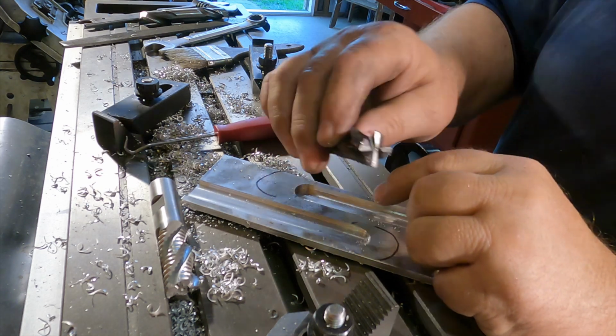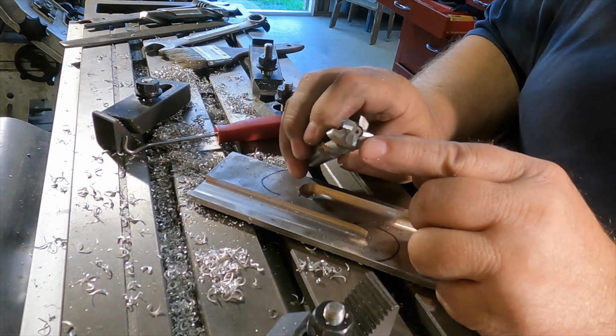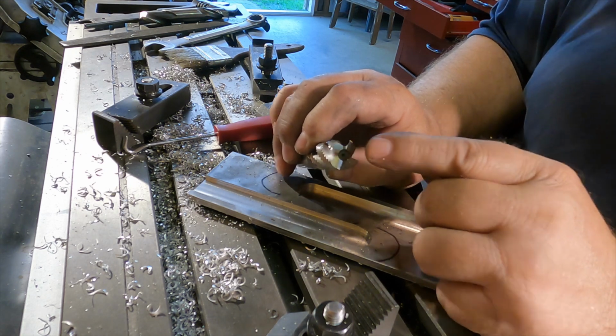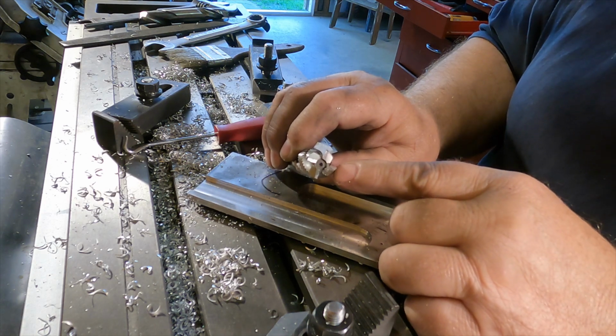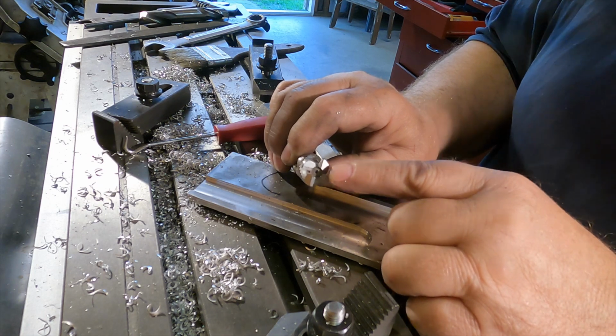So anyway, I got rid of this cutter, and I used this cutter. Problem solved. This cutter is not center cutting. I don't know whether that one's center cutting or not. But anyway, I wasn't center cutting, so I didn't need one that was center cutting. And this made all the difference in the world.